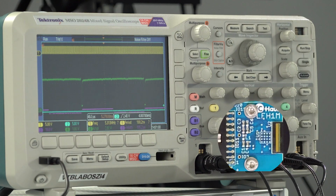In an application with a dedicated light source, one can pulse the light source and synchronize it to the time the global shutter is open. This then would reduce the influence of ambient light. I am just using ambient light as my light source today. So the easiest thing to do to test the functionality is to cast a shadow on the sensor. If I place this little wire across the sensor, immediately there's a dip in the green signal trace.